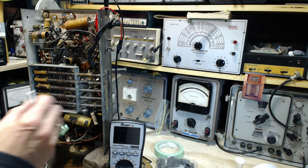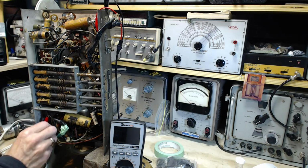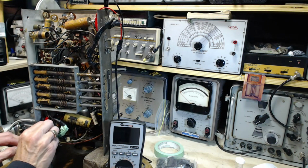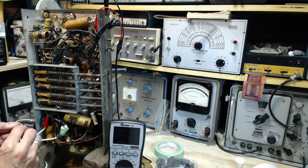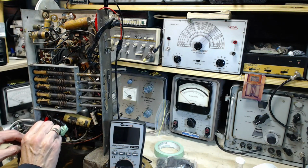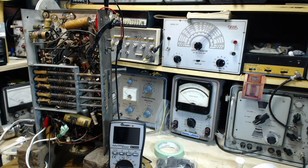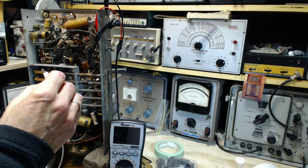So we're going to put this on the negative bus, this radio, which is way under here. The chassis is not the negative bus in this radio. And one of the hints that that's the case is lack of a cathode resistor on the output tube. The output tube has to get its bias from somewhere. It's not getting it from a cathode resistor. It's probably getting it from that power supply trick that I failed to explain.